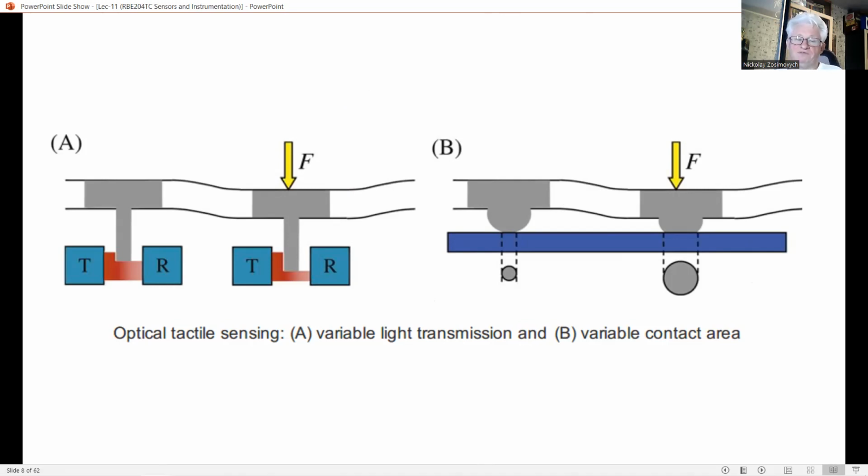The resolution of this tactile sensor is restricted by the number of elastic bulbs. The camera is not limited with respect to the resolution. However, it makes the sensor rather bulky and unsuitable for incorporating in a robot gripper. An advantage of this setup is that scanning is performed by the camera electronics, hence the speed is high.